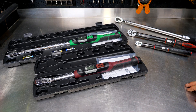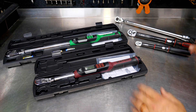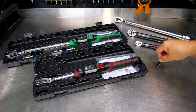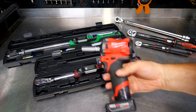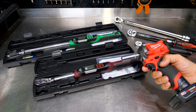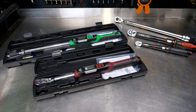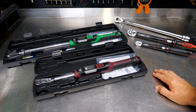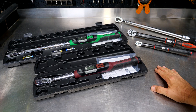Why would you need multiple torque wrenches? Before I get into that — I have no problem with people buying used tools. Whether it's a used impact driver or impact wrench, if they work for you and save you money, great. But when it comes to a torque wrench, I would not buy a used one. You just don't have any understanding of where it's been, unless you actually have it calibrated.